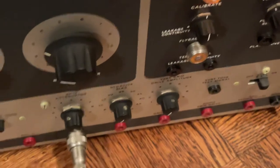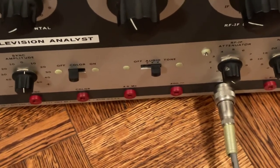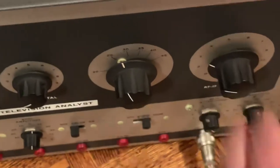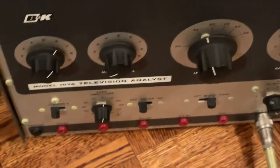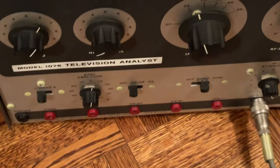There's a test television, and you have, of course, a 4.5 MHz sound carrier which is modulated with FM at 25 kHz deviation. So it's a complete transmitter. There's a VHF tuner and an IF tuner as well, so you can get RF signals modulated or baseband signals to troubleshoot your television set.